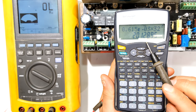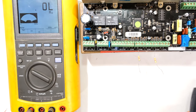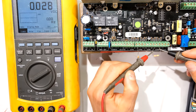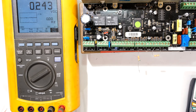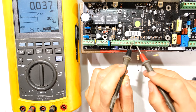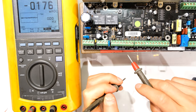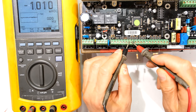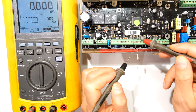This is an important voltage — when I use the single end-of-line resistor of 3k3 I should be getting about 2 volts. Let me verify by measuring the voltage directly across the zone with the resistor connected: the meter reads 2.008 volts, very close. So what are we checking for? We're checking that the current out of each zone is the same. If one zone reads 1 milliamp and its neighbor reads 0.5 milliamps, something is wrong with the driver circuit. I've now shown you testing using voltage and current.